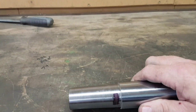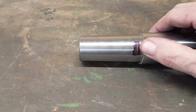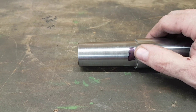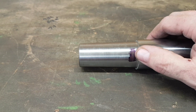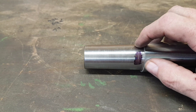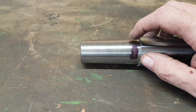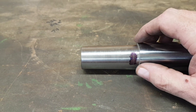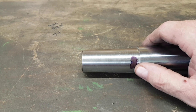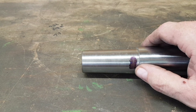The reason I'm showing this is — if you've noticed, I've marked it — and this particular mark here is how far this handmade taper will fit inside of the spindle. What I've done is taken the measurement at about four or five millimetres further down the taper, and that was my largest diameter on the taper I'm making. So the plug will sit subsurface, and later on you'll see the reason why.